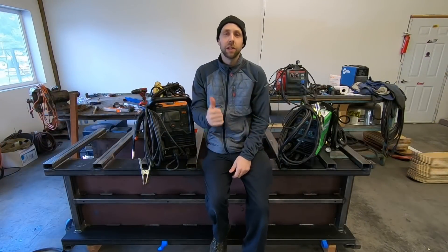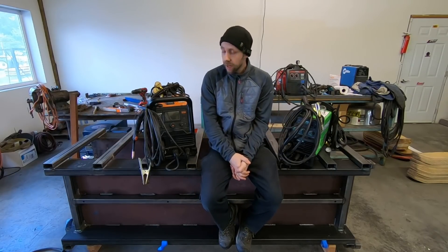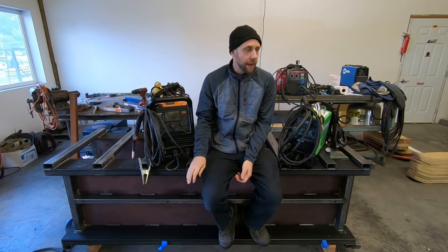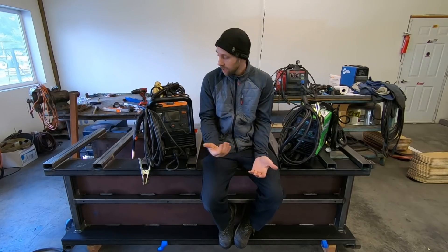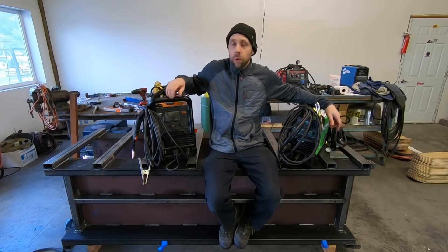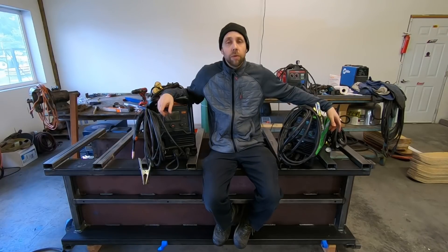Got the glue press all wrapped up here. It's gonna be a pneumatic glue press — it's gonna have airbags in here for pressing wooden blocks that are glued up. This is actually one of eight of these I have to build. This one has about 65 to 70 feet of weld, so there's quite a bit of welding that could be done on these. I used both machines on the whole process and it worked great. This is a real-world review of duty cycles on these things, and I think they work really, really well. I had no problems with them overheating on these cycle tests.